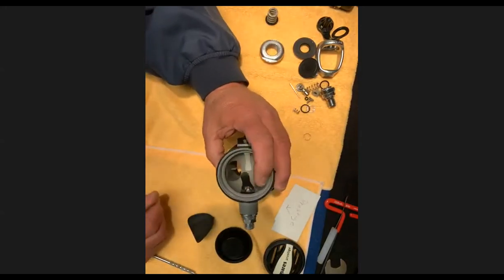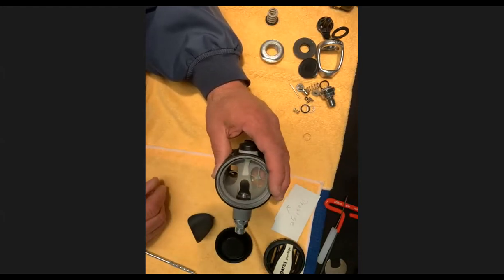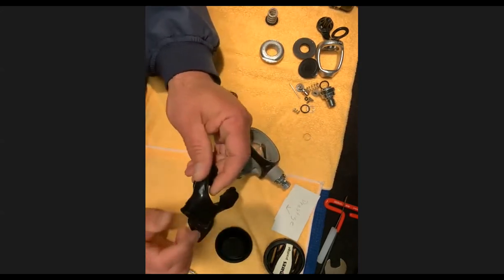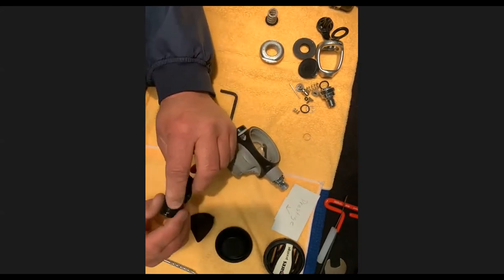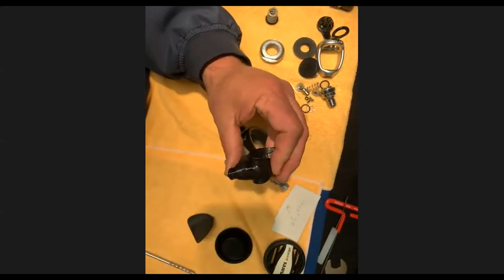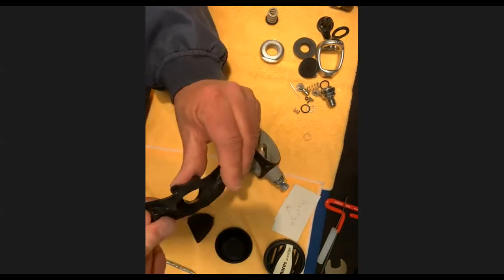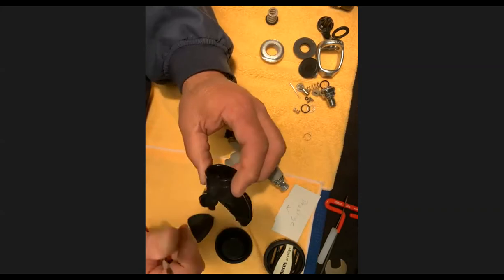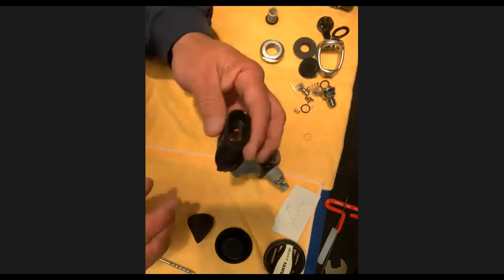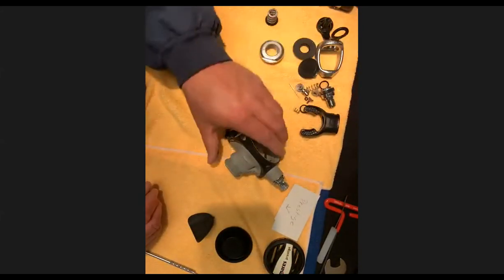We'll also show you how we set how much air we're actually, what the cracking pressure, they use the word, is for that. All right, so then you have your mouthpiece. Even as you're diving, or before you're going on a trip, right in this part of the mouthpiece, you want to look for cracks. Lately, I don't care what brand of mouthpiece it is, they seem to check up and crack really easy. So that's one of those things that you want to put in your Save a Dive kit, and you want to have an extra mouthpiece around.